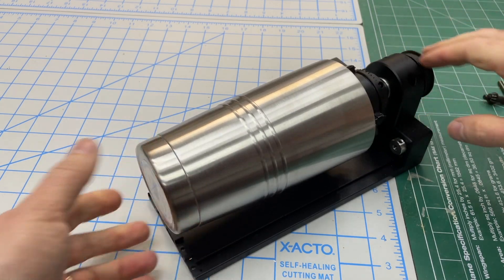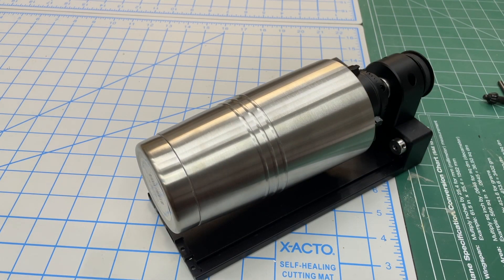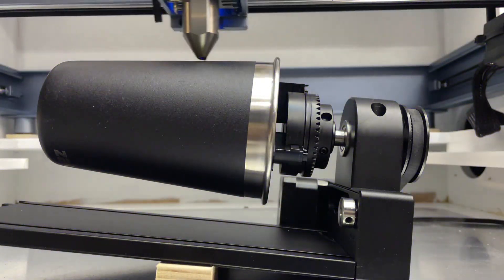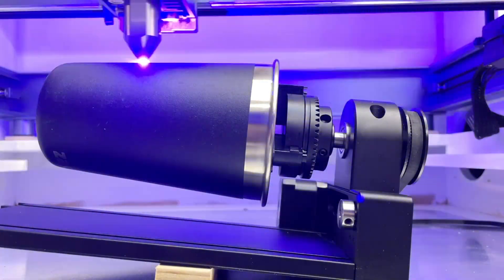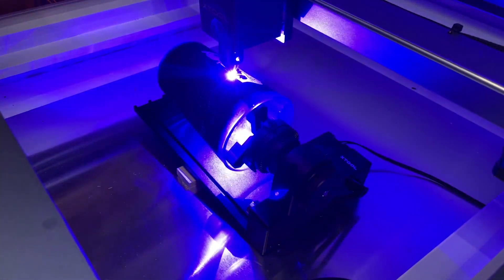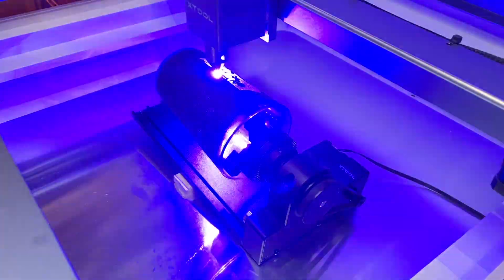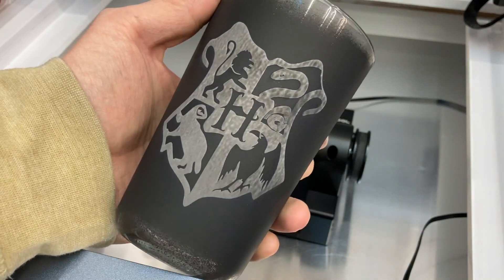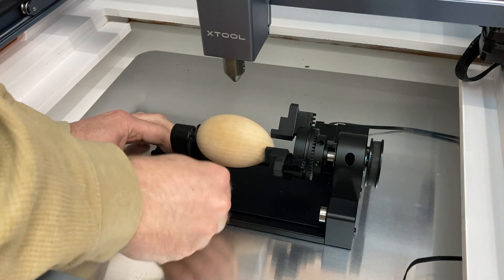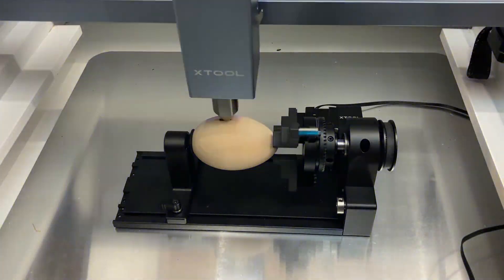Now it's going to turn without walking. Here we have the chuck rotary in action with a coated tumbler — it's a straight taper, so I chalked it up with a block to make sure the tumbler was level with the laser head surface. In a similar setup, we coated a glass tumbler with tempera paint and ran the laser across that to engrave into the glass surface. Now we're adding the tail module to secure a wooden egg, and we'll burn a happy Easter logo onto it.